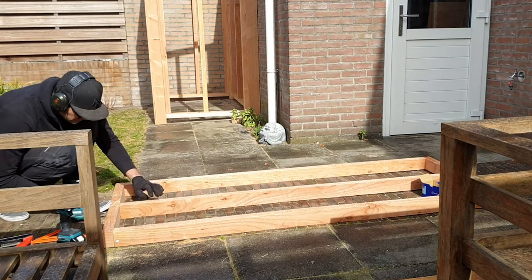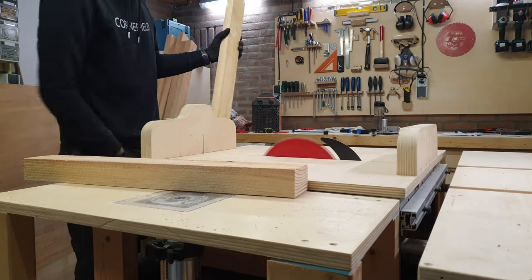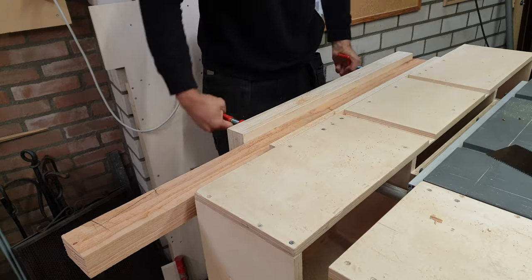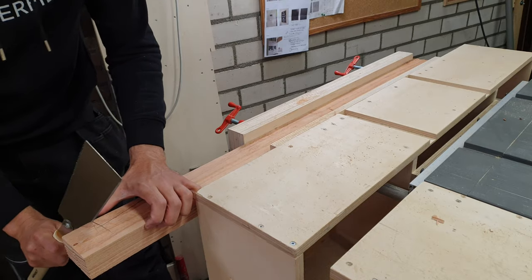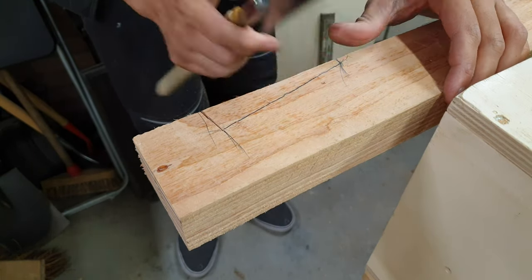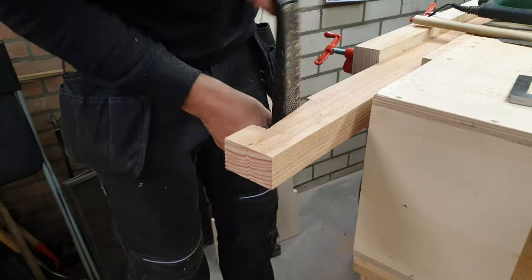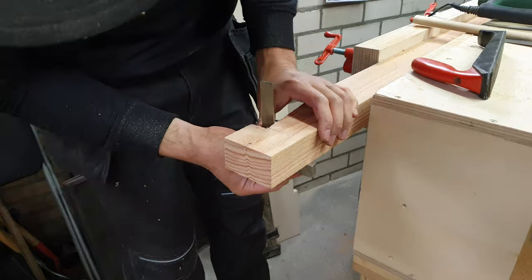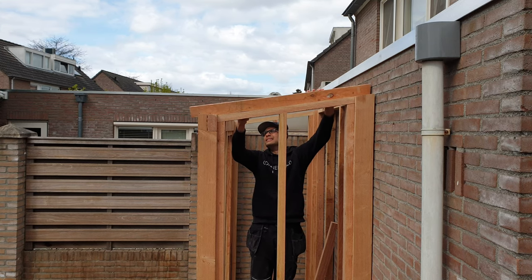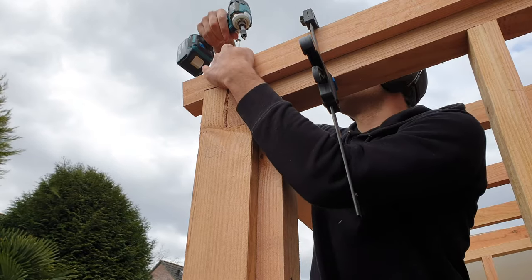Next up was cutting the rafters. I first cut them to rough size so I could get the 9 degree angle on my table saw. Once I had those I measured the exact length I needed and cut them all to size. Then I marked out the bird's mouth using the actual frame to mark it. It's this shape you see here. It ensures the rafters stay in place and it gives extra strength to the whole structure. Once I cleaned up the markings I cut it out using my pull saw, first staying shy from the line and working my way to a nice fit, checking with every step so I make sure I didn't remove too much. With one piece exactly right I could mark out the rest and cut them. Before installing all the rafters I fastened the ones on the outside, then spaced out the rest and measured how long the pieces in between needed to be. I cut those to size and I could install the entire roof structure.